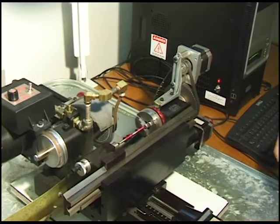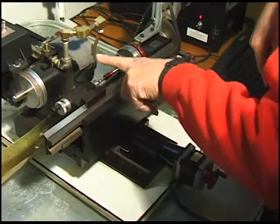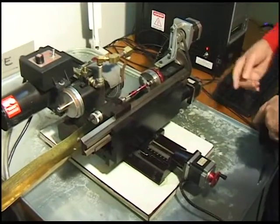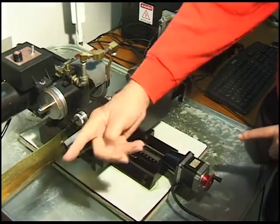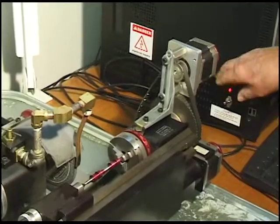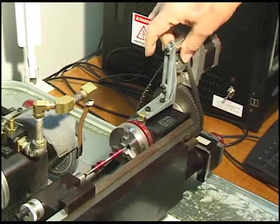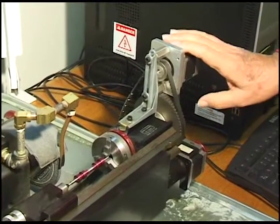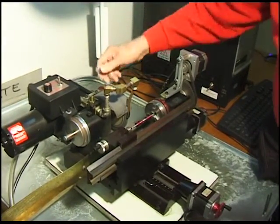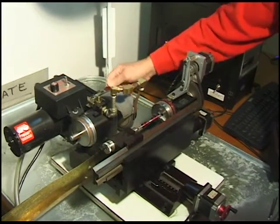First we've got the Y-axis here. The Y-axis moves in this direction, which will drive it into the grinding wheel, and the grinding wheel is fixed. The X-axis moves it across, and this here turns it — I get a 4 to 1 ratio rather than a rotary table. To start things, I'm going to dress a couple thousandths off the wheel.